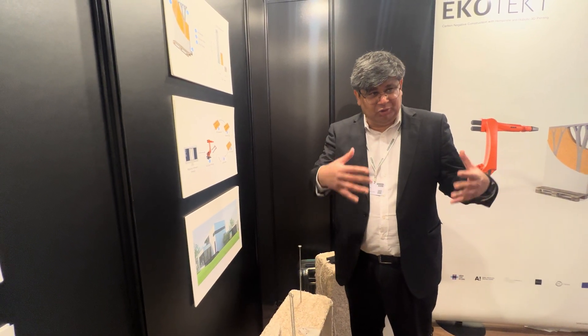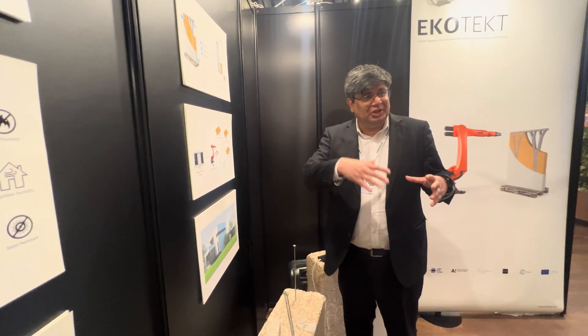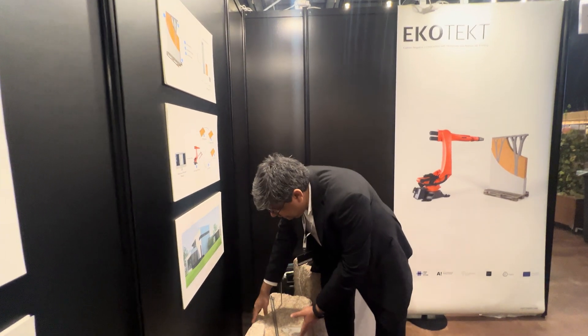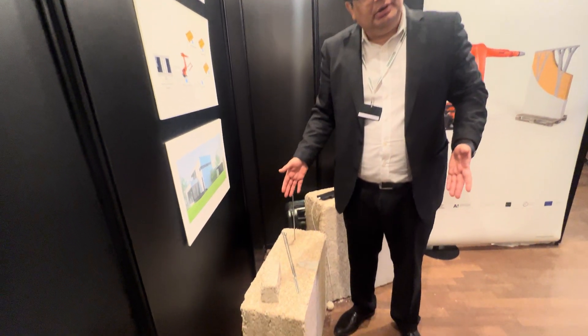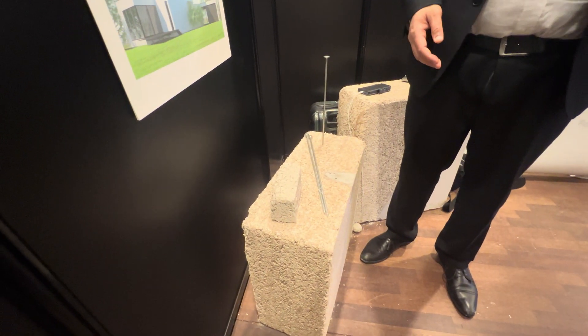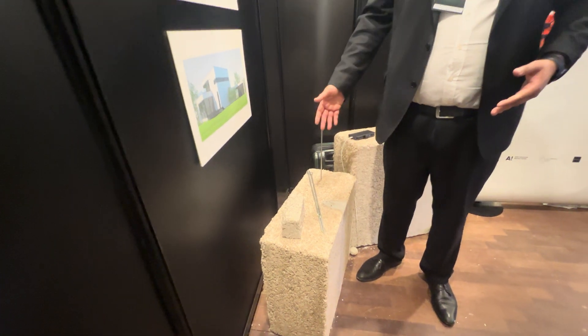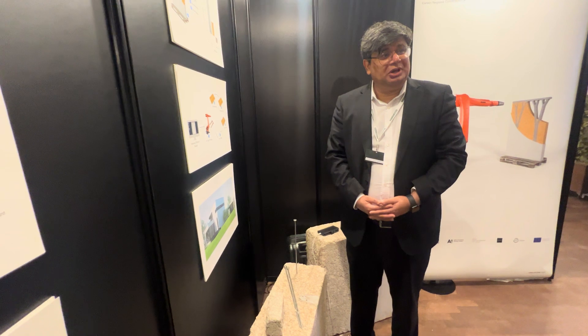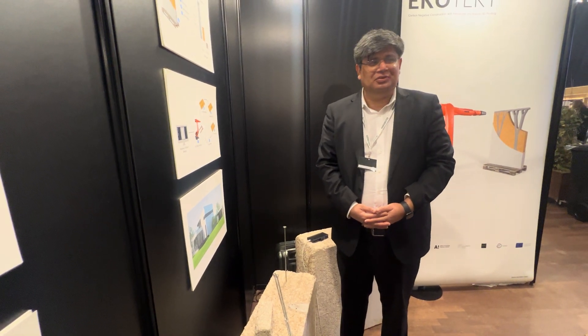Because what happens after the demolition of a site, styrofoam goes into the landfill and floats on rivers. Here, we don't need any separate insulation — 400 millimeters of thickness will satisfy the conditions in Denmark. And it's completely a proven material, so it's easy to obtain building permits or insurance.